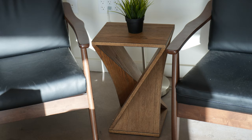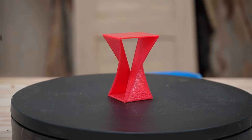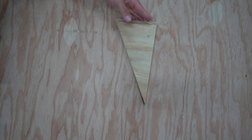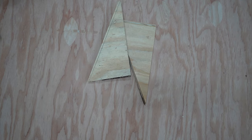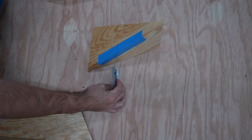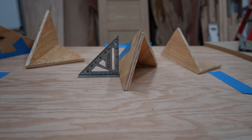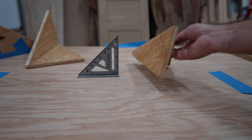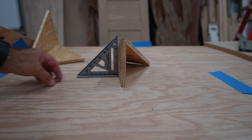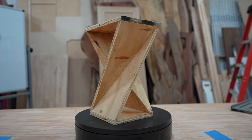I thought it might be interesting to share what went into doing this project. It starts out as a design in Fusion 360, which then gets sent to my 3D printer at one-seventh of scale, so I have a model to look at while I build a prototype from scrap at half scale. While building the prototype out of scrap wood, I had a lot of test pieces. I had the 3D rendering and some measurements written down, but knowing the angles and understanding the angles are two different things. With the correct angles, this should have been 90 degrees, but clearly it wasn't. The next piece was 90 degrees but there was too much gap on the backside. So I went back to Fusion and got every single angle and complementary angle, supplementary angle on the whole project and tried to wrap my head around the ones I need, and made a blueprint with everything labeled. From that I was able to make my prototype. This blueprint will be available in the description of this video.